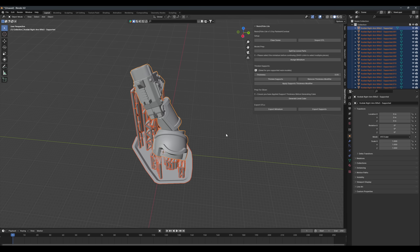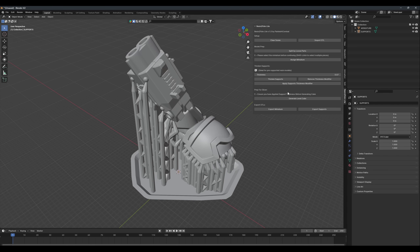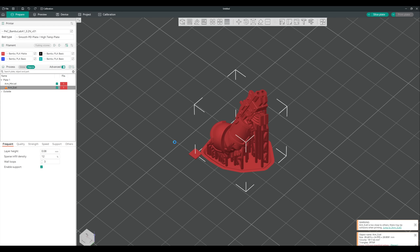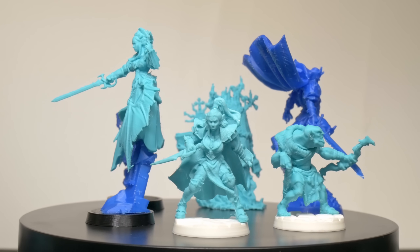This process not only allows us to beef up the resin supports so that they're compatible with FDM nozzle sizes and printing methods, but also allows us to pull the model apart in our slicer, enabling us to increase the print speed for these supports, because we do not need miniature-level detail and care being put into printing the support material. And I reckon the results speak for themselves.